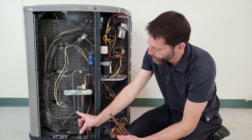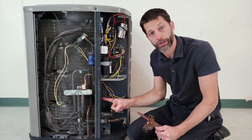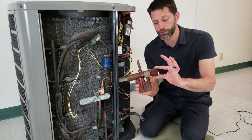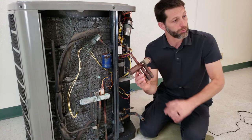That's a port you can access after taking this grill off. In this case on this heat pump, there is not a third port over here — it's actually located there. On the back of the reversing valve there's a little electrical solenoid, and that is what's powered in order to change the directional flow of the refrigerant via these two little tubes here.